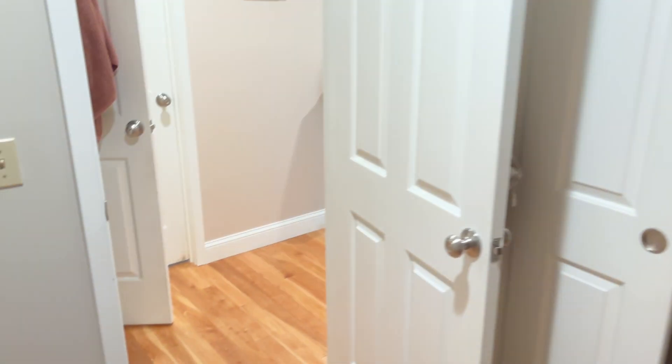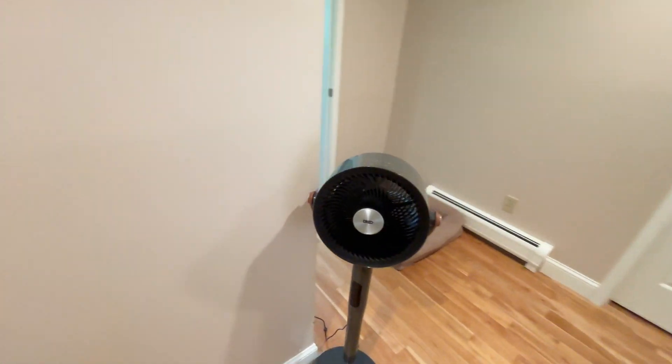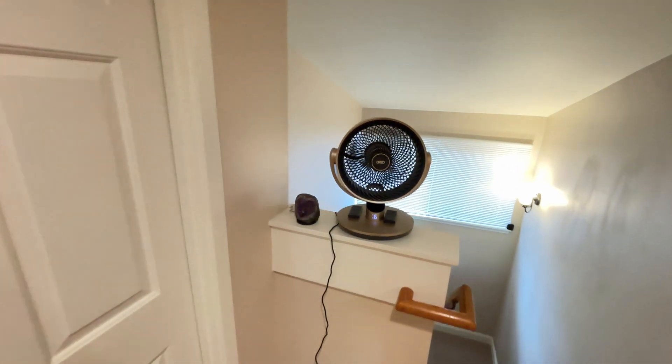Here's another tip to reduce mold growth in your home. To allow your AC to dehumidify your space effectively, it should be running for extended periods of time. You can turn the fan on its lowest speed, or you can try using dry mode. You can also have the AC cool larger spaces by opening the door of the room the AC is in and using a fan to circulate air between that room and the rest of the home. Dreo makes the quietest and most powerful air circulating fans I've found — linked in the description. They produce a narrow airstream that's great for preventing comfort issues.